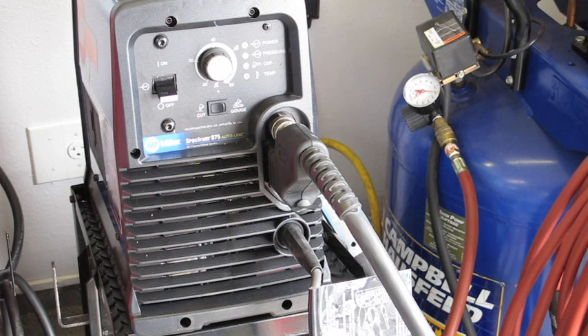I know the parameters of this machine and the thickness of material it can cut, so I'm not going to try to go beyond that. You've got to realize that plasma cutters are intended more for thinner materials like sheet metal, and thicker materials are best left to other devices such as oxyacetylene. But the benefit that plasma has over oxyacetylene is that plasma can cut any material, whereas oxyacetylene cannot. Oxyacetylene is basically just for ferrous materials — steel — and it will not cut stainless steel, aluminum, or other materials, whereas plasma will. Plasma just blasts through anything, and that's the benefit of it.